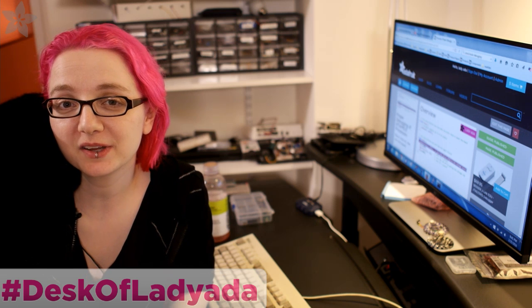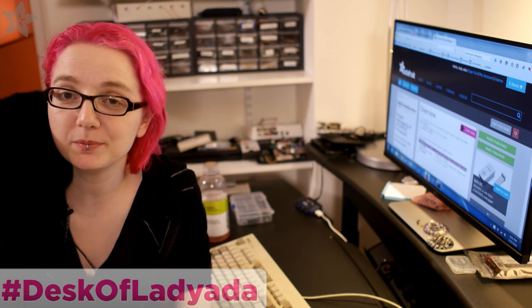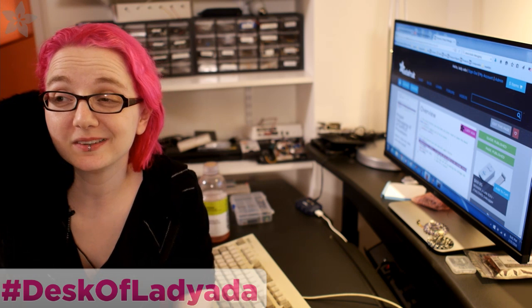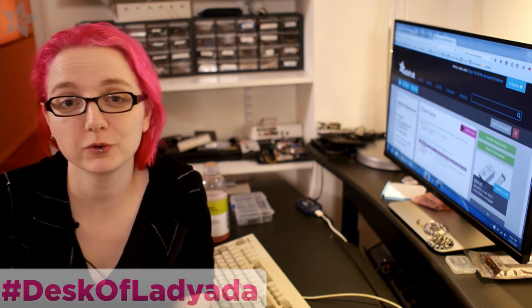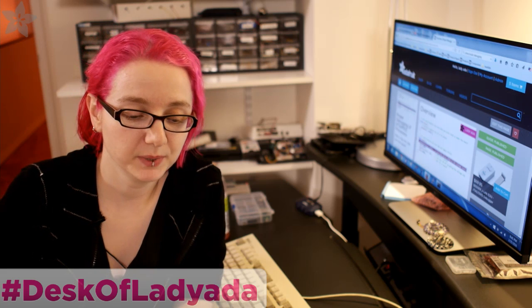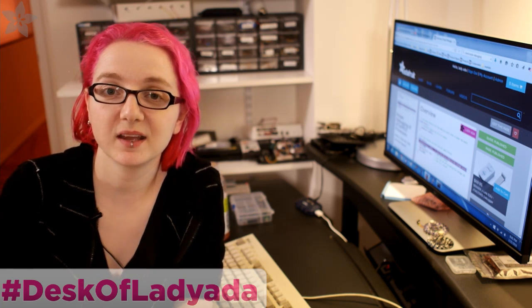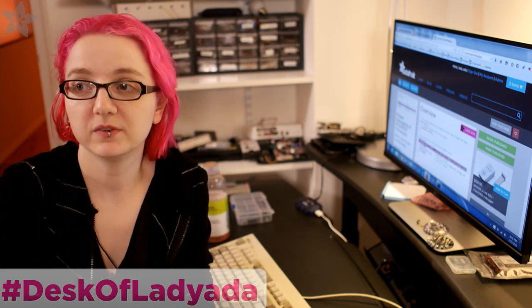So tonight we've got a fun little show. We're going to be doing some step debugging with Atmel Studio. This is something I wrote a tutorial about earlier today, so it's fresh in my mind. I thought it would be a good time to go through the tutorial and show you how you can use a proper debugger to debug a processor, a breakout with an ATSAMD21 processor, such as the Arduino Zero.